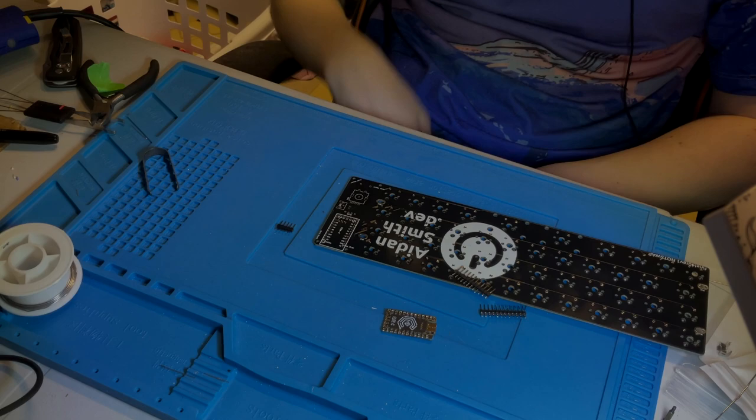This is an editing note: with the microcontrollers, you want to make sure that when you solder, the circuitry components you can visibly see — the processor, the button, and all those things — are facing towards the PCB. If you face it the other way, it won't work at all. If you want to be absolutely sure, there are silkscreenings on the PCB for both the nice nano and the Elite C so you can match the labeled pins on the microcontroller to the pins on the board.